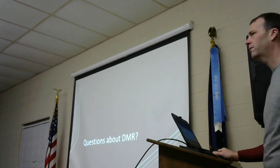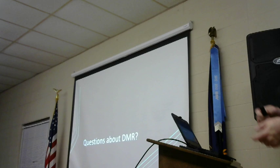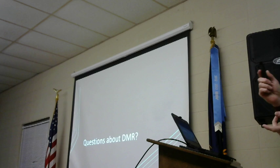I have heard there is some kind of private person-to-person call that's normally disallowed. Private calls, yeah. And that's totally up to the repeater owner. But yeah, you could do a private call. You can type in someone's DMR ID and talk directly to them. But it's not private. Anyone listening to the repeater with one of those radios in monitor mode will hear it. So it's not encrypted or anything like that. It just doesn't show up on other people's radios if they're not purposely open to everything. If they're not in monitor mode, they may see the busy light on their radio and their S meter go up. That's probably why people don't like it. Yeah.